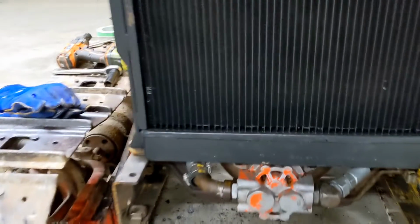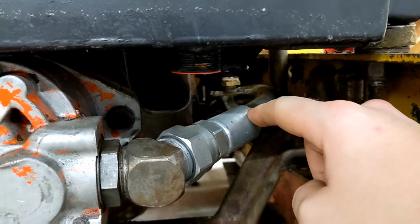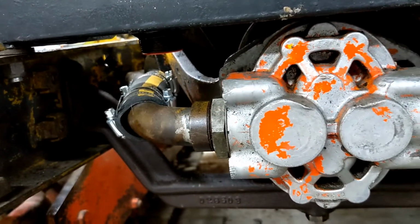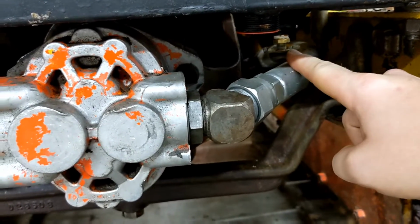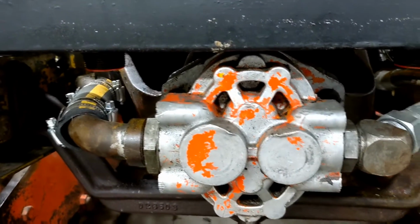Okay, guys, I was going to go after the antifreeze first, but of course, some engineer was involved, and our petcock is right above our hydraulic line. So that dictates that we're going to have to drop the hydraulic oil first, and then we can remove this line, then remove the antifreeze. This has the potential to be quite comical, so we'll bring you along.